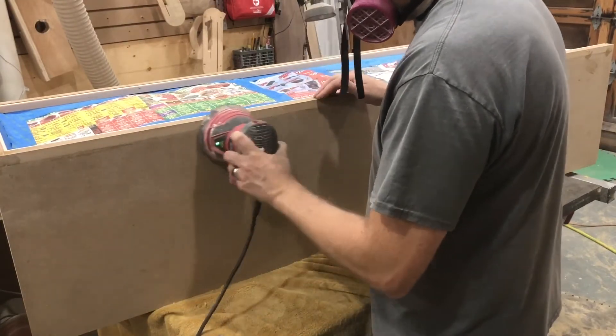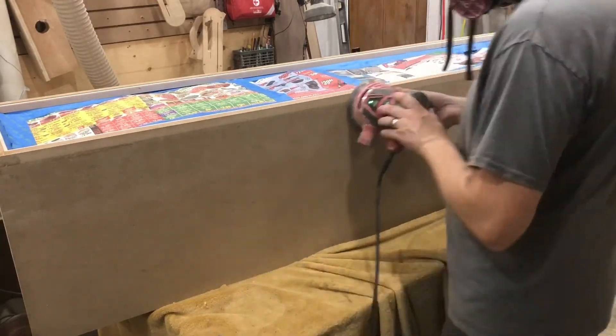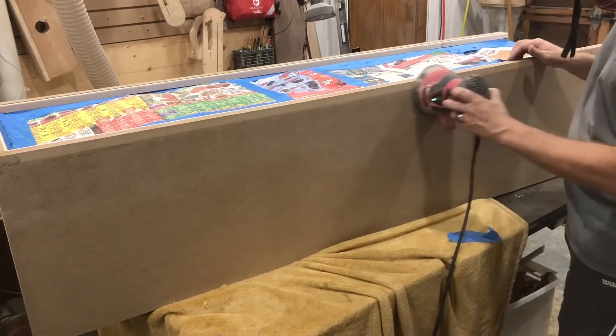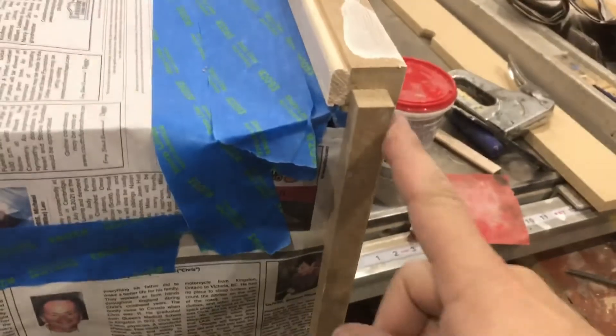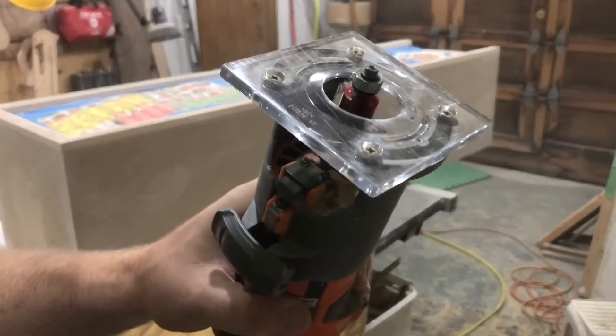I'm cleaning up some of the excess glue on the project. When you're doing MDF, squeeze out is actually a good thing — different from the walnut interior where I didn't want it. Once I did that sanding, I filled in every joint whether I thought it was bad or not, using a standard spackle wood filler. This stuff sands super easy — it takes almost nothing to remove. Those little feet I pointed at are just there for finishing so the cabinet isn't sitting right on the ground.